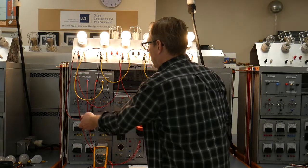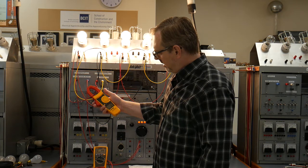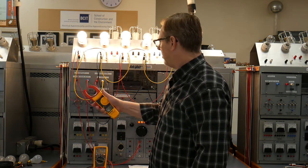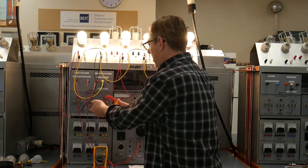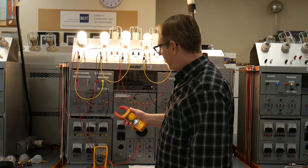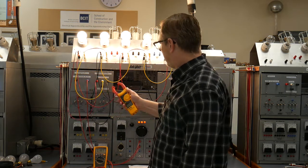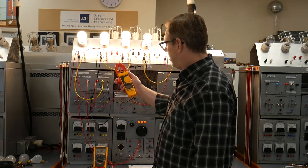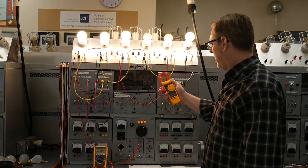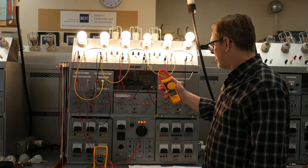My line 1 conductor, I anticipate 2.2, and we're climbing to, I've got 2.1, 2.2 there. My line 2, I should see the same, 2.2 there, and my neutral initially should see 0, which we have. This jumper J2 still has 0, but remember I anticipated some current on J3, and I've got the 0.2 amps that I anticipated there based on my calculations.